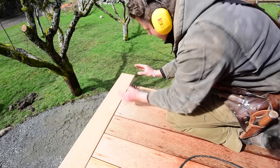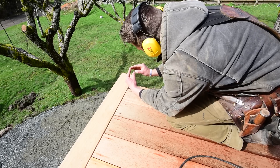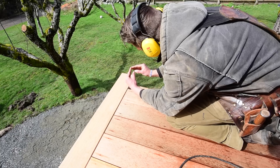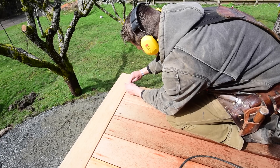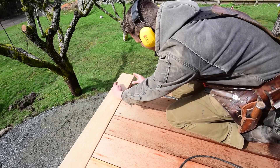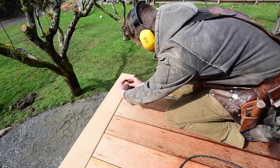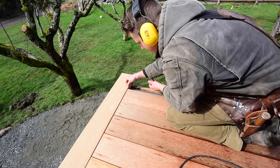If any of you have done miters in green wood, you know that even if you glue and screw a perfect miter together, a gap is gonna form right at the heel of the miter. When you put two boards together with a 45-degree cut, the boards shrink width-wise — you can see how when the boards shrink together from both sides, the bottom part of that miter opens up as the wood shrinks away from the joint. The toe always stays tight because it's shrinking in toward itself, but the heel shrinks away, so you can get gaps up to an eighth or quarter inch that were perfect when installed.